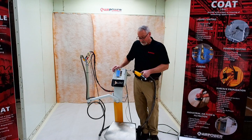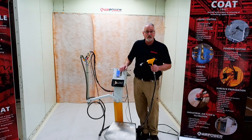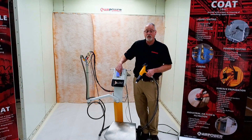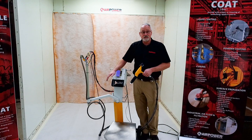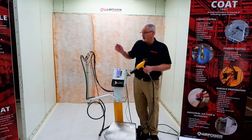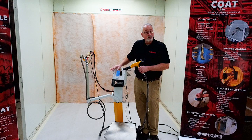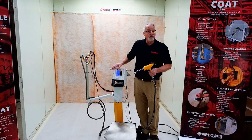When we go into the power boost mode, we can do that from the controller or from the gun. If I'm painting an area on the part and I want maximum voltage and maximum powder flow, I can do that from the gun or from the controller. We can set that into your recipes. We have 20 programmable recipes where you can set up the voltage, powder outputs, rinse airs, and fluidizing airs. For your parts, you take a picture of your part and your recipe settings and hang them along the line for the operator. It remembers those settings every time you go back to it.